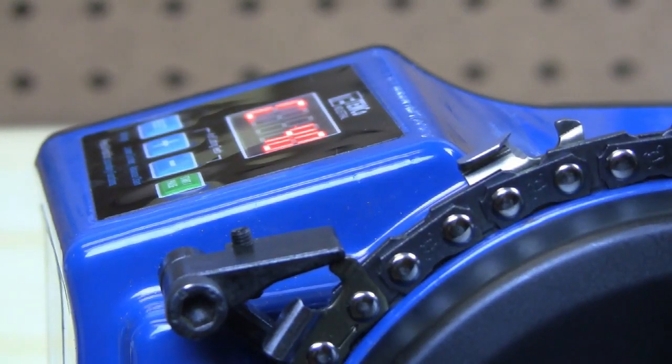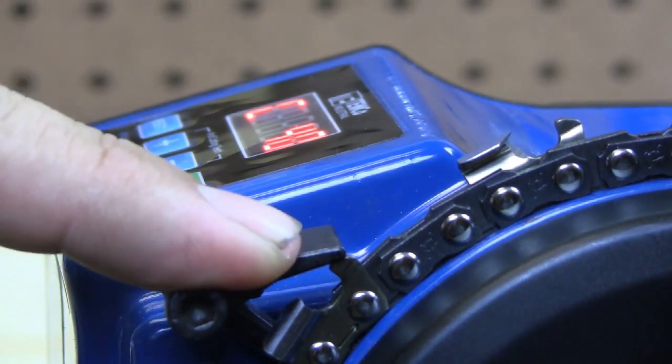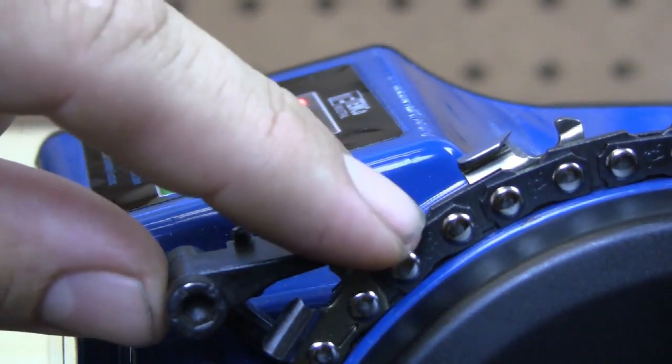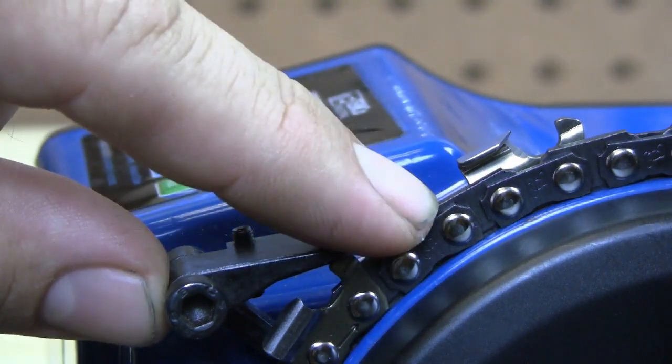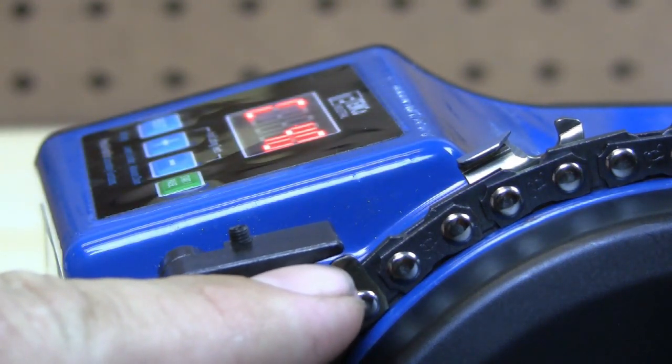After you've pressed reset, you'll want to check the position that the advance arm returns to. You actually want it to sit right above the rivet, one behind the cutter. So this is too far back — you can see it's going to get caught on that depth gauge.